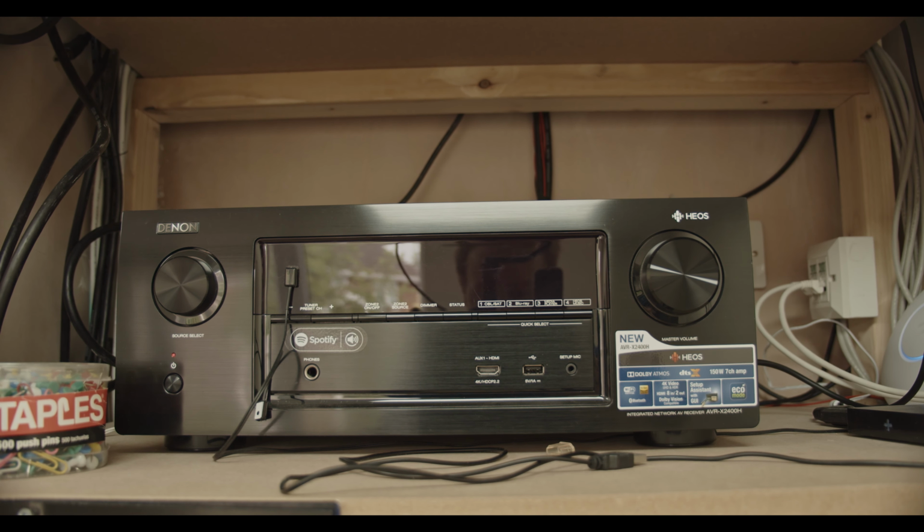Okay, at the back of the cabinet here, I've got some more exciting stuff. At the top of it, I've got some BNC patch panel that drives my CCTV and also links to my wildlife camera, so I can patch them in as and when I need to, which is really handy. And then below that, I've got a 24-port Cat 6 generic brand patch panel, and then a bit of an attempt at cable tidy. And then another MikroTik CSS326-24G-2S, basically the same one as in the other comms cabinet, but this is for my data center switch.